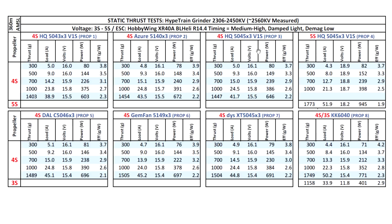This motor will most likely be used on 5-inch props, so I tested on 4S with 5-inch props — the most common setup — and also ran a 5S test with a 5045x3. The amp numbers versus thrust correspond to what it's supposed to be, basically just under 1500 grams at 43.5 amps. Applying the unloading effect, that's just under 30 amps max burst in the air — around 27 amps — and that's only for a couple of seconds before it tapers down. On 5S, 52 amps is almost equivalent to about 30 amps in the air at max burst. So 30 amps on 5S with a 5045 is no problem for this motor — it should sustain operation on 5S.